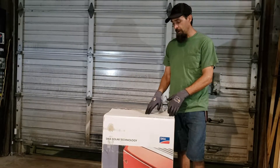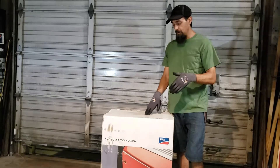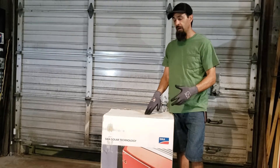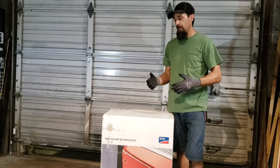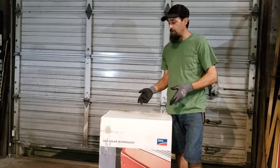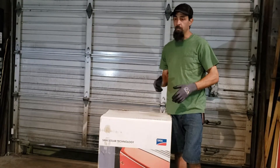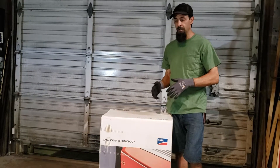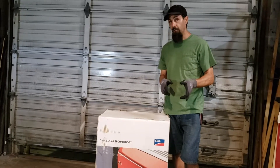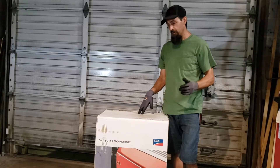For your bang for your buck, for just a few more panels, we would have had 6,000 watts instead of 3,655. So if you're trying to do something real simple and easy, the micro inverters are the way to go — plug and play, great. Smaller setup if you're not home a lot or not using stuff a lot, it will work out just fine. You can't use the micro inverters and the string inverters for the off-grid stuff — they use a totally different type of setup.